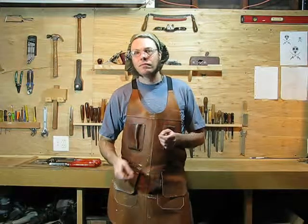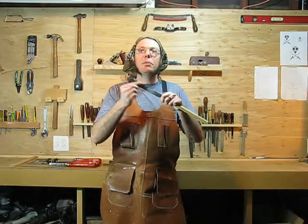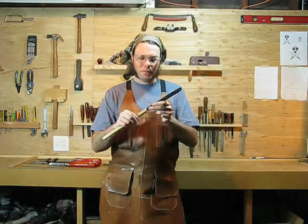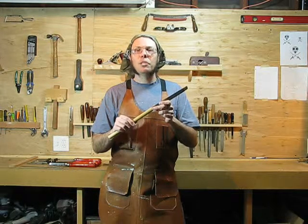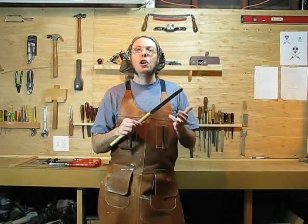A few minutes ago I talked about how you can make your own tools. Actually, just about every serious turner I know makes their own tools, especially things like scrapers and skews, which are flat and easy to work on. Here I have a tool I made — it's a skew, and it started out as a worn-out file. I just smoothed out the teeth on my belt sander, then used the belt sander to make the skew edge on the end, then I sharpened it and tempered it. Tempering is something that confuses beginners quite a bit, but it's actually very simple. It's very hard to show in pictures or on video — especially with digital cameras, they don't really show the colors of the metal as they're heating. So I made a little animation to hopefully clear things up.